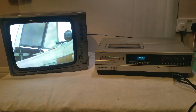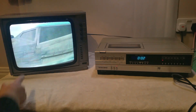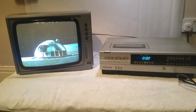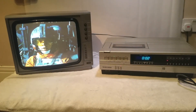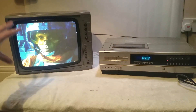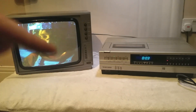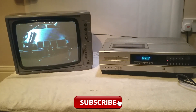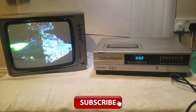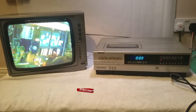There you are — that's one happy bit of kit. There was a line on the bottom of the screen but it's just disappeared. All in glorious 12-inch technicolor — obviously in real life it looks better than what you've seen there. Still getting some flashes, but I think that's related to tape tension because it doesn't appear on other tapes or all sections of this tape, so I'm still going with the tape tension theory. We hope to do a video on that, so that could be fun.